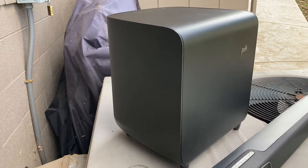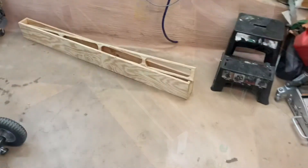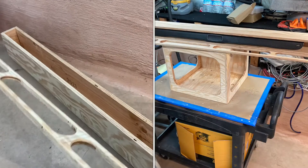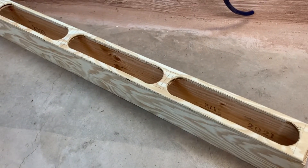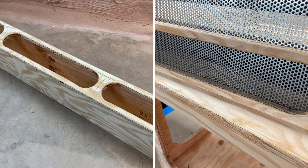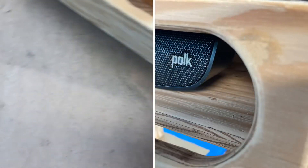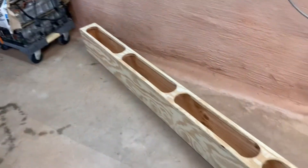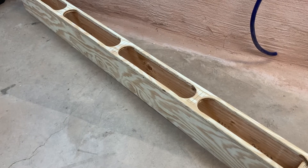I've got the basic shape together — here is the box that the soundbar fits into with plenty of room to spare. This is the grill; I'll put a little hinge on here and use some expanded metal — the thin metal with tiny holes, typical speaker grill stuff. Before that, I'll wood putty all the little chips and holes in the wood, then take it to get rhino liner sprayed on it, which really waterproofs it.